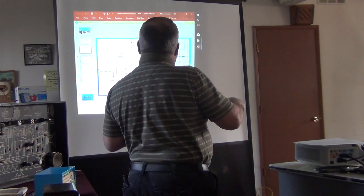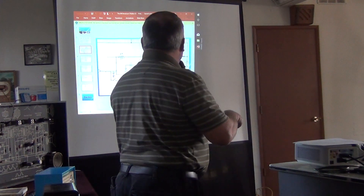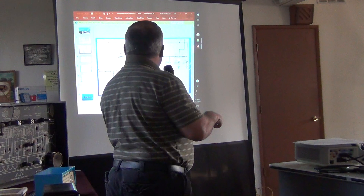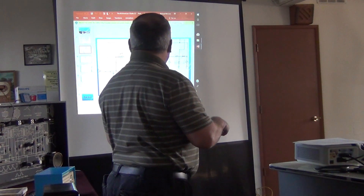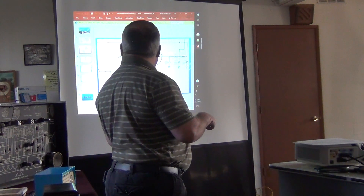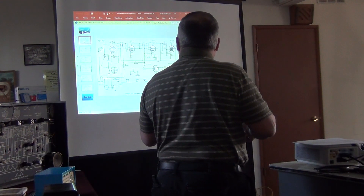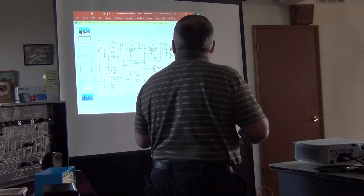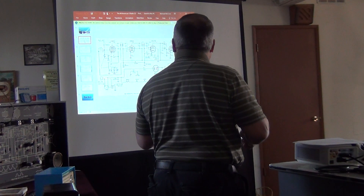The DC voltage at the cathode still has heavy 60-cycle ripple from the AC line. If you connected it directly you'd have tremendous hum. The filter system consists of two electrolytic capacitors, both rated at 40 µF at 150 volts each, along with divider resistors. One line here feeds over to the screen, while another branch feeds through the transformer to the plate.